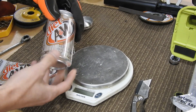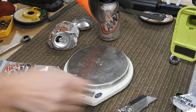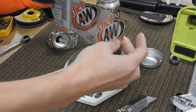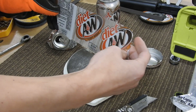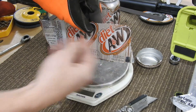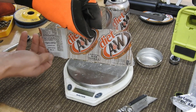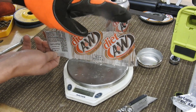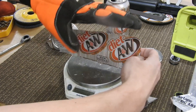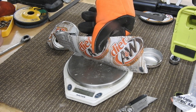So here we've got the same soda cans — they're all exactly the same. This is the one I just crushed with 130 pounds of weight. And this is one of the soda cans where I've cut out the metal that makes up the actual support. This piece of metal was supporting 130 pounds before it suddenly collapsed. If you take this exact same piece of metal and use it to support something in a way where it's not structurally sound — not supported by the sides — I'm getting 8 ounces of support before it buckles. And if I bow it slightly, you actually get a bit less — about 6 ounces.